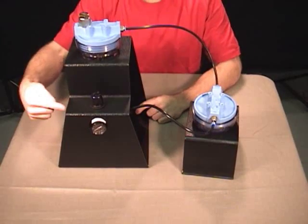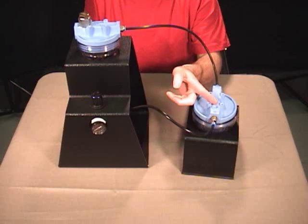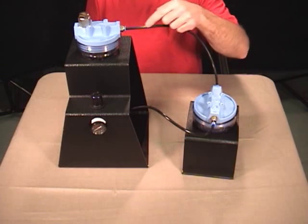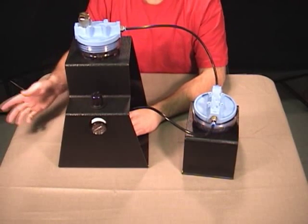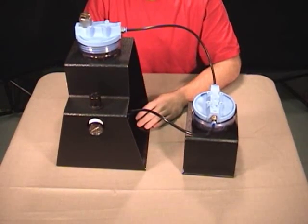So now you've made a loop of air. The air comes in, goes through your filter regulator, comes over to the desiccant filter, the air is sent through the desiccant filter, the moisture is pulled out of the air, comes out of the desiccant filter up to the pressure pot and into the chamber where the sand is, and out to your blaster. That's how you connect the desiccant filter to the pressure pot on the para-blaster.